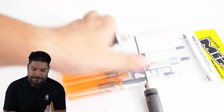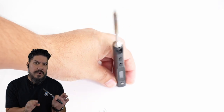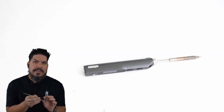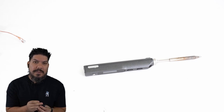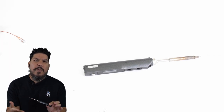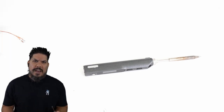Next up, you need a soldering iron. You can get a cheap one on eBay for $10–$20 and it will work okay, but I really recommend spending $40–$50 on a TS100. It's a portable soldering iron good enough to use on the bench for every build, and you can keep it in the field. If you crash and a motor wire comes loose, you can repair it in about 20 seconds by hooking up a LiPo battery to it.